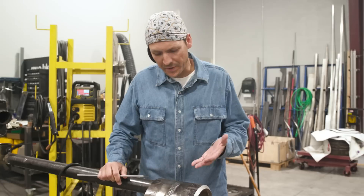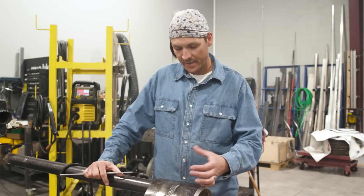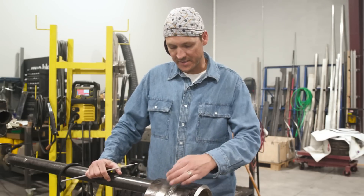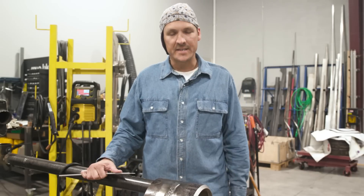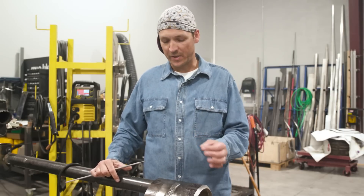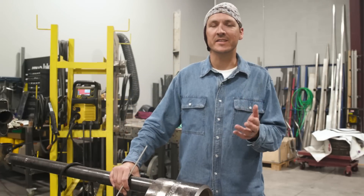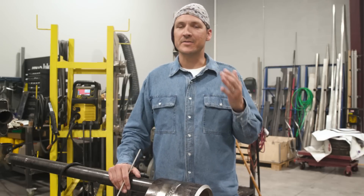That's it for the repair. We did our best to keep this as uniform as possible in our two sections. I ground down my cap flush here so we could do one big section of cap instead of having little stops and starts with extra grind marks. Keep in mind we ground down our stops and starts — in some situations, some procedures may not allow you to do that, but we did it in this situation. It's super important to follow the code, follow the procedure, and always listen to your inspector. Keep in mind they're just trying to get a sound weld so nothing fails down the road, and this is only going to make you a better welder. Be sure to like, follow, and subscribe.